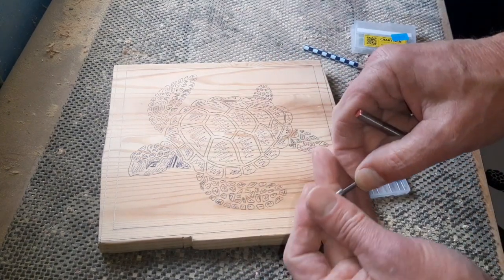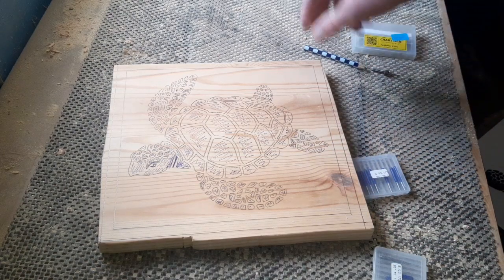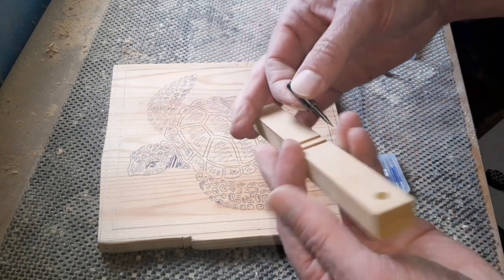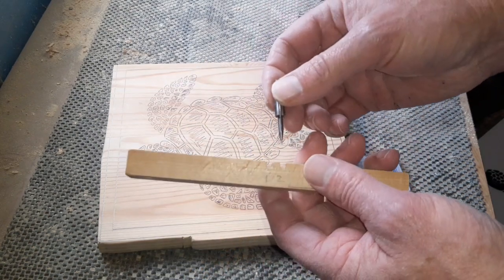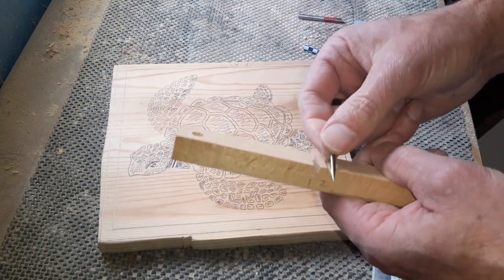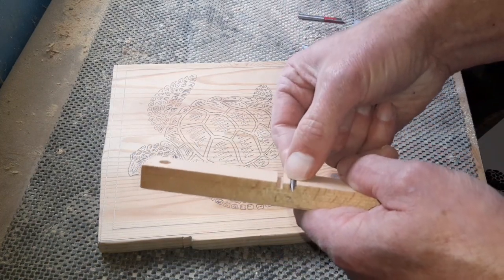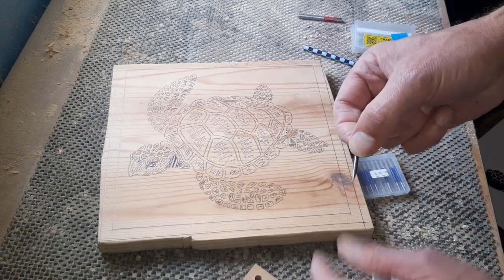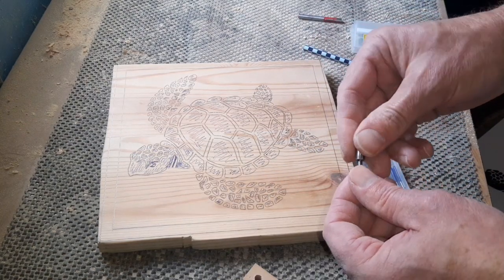And the idea is we'll slide that into there, simply set it to 3 millimeters. I tend to use 3 millimeters on all my projects. I made a little gauge out of a piece of wood. You can buy depth gauges, and I know that's 3 millimeters because it just happens to be the same thickness more or less as this CNC bit, and that's plenty deep for me, and I tend to use that on 90% of my little projects there in the shed.